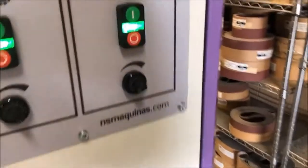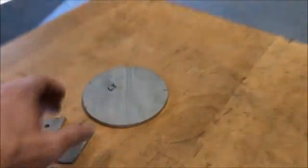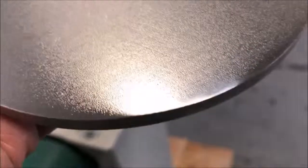We are going to start with the thicker materials — running about 30 inches per minute at full speed on the front belt. Here is our quarter inch. You can see this makes an excellent edge. It doesn't really remove any material from the surface — you can still see the mill scale through it — but you see a little bit of grain on top.